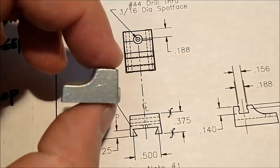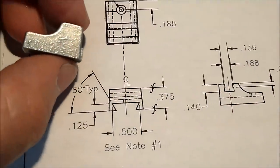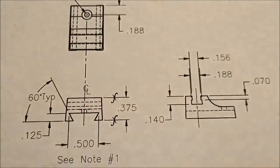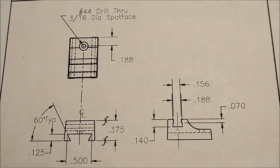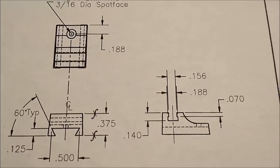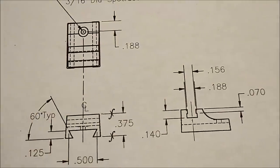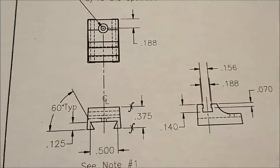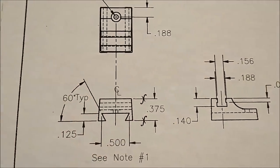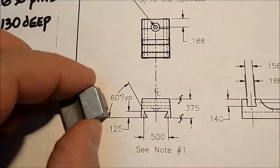So take a piece like this and give it a good look-see, compare it to the pictures, compare it to everything and any reference material you can find and figure out what we're going to do. Now, one of my favorite sayings, and you guys should write this on the wall: when the chip exceeds the grip, you can bet the part will slip. That just boils down to, if you're holding on a 16th of an inch worth of a piece, a quarter of an inch long, and you hit it with a 2-inch end mill, chances are the end mill is going to win that battle because the grip just does not encompass as much surface material as the cut.